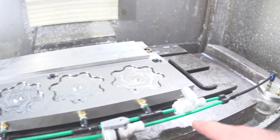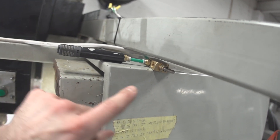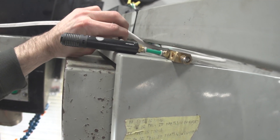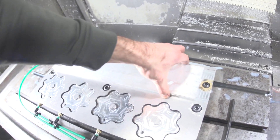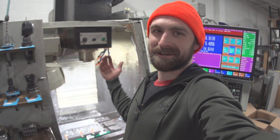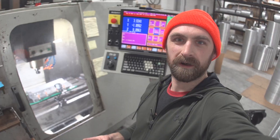I've got vacuum lines running into these valves and then into a mason jar, and then a vacuum line going up. This is a vacuum generator and a pneumatic switch. When I flip the switch, air flows through the generator and creates a vacuum in the line that goes down to the mason jar and through to the fixture. Right now there's a vacuum underneath this piece and I cannot lift it at all. So now we're going to run some coasters. I haven't run this program in a long time — it worked last time, it should work, but you never know. I've got this little Sony action cam with a waterproof case — I'm going to mount it to a mag base inside the machine for a cool time lapse. Let's call it the danger cam.